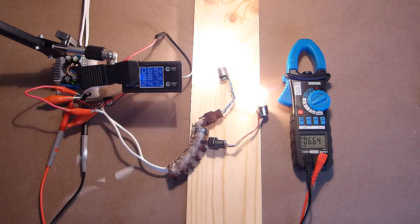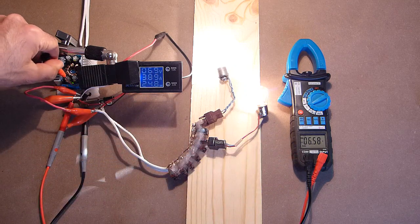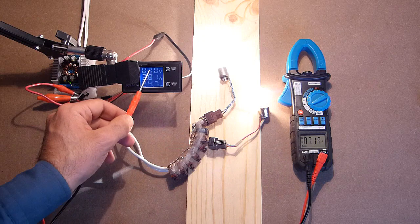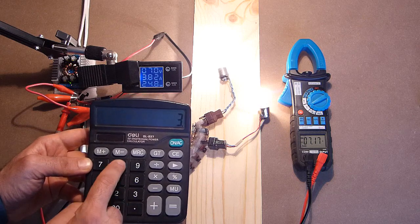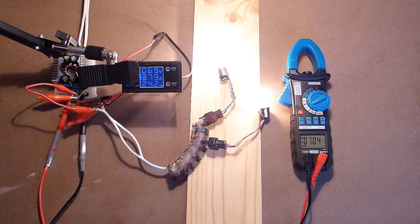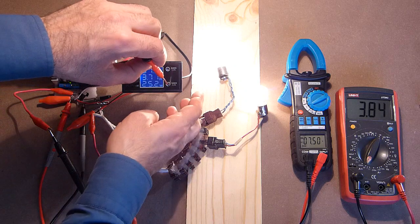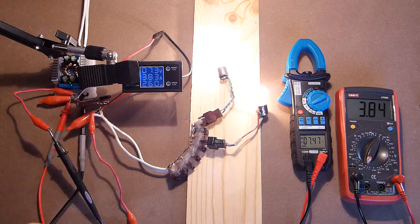The discrepancy may be due to insufficient operating voltage — here we have 6.9V and the reference reads 6.6V. Let's increase it. Readings are now 7.1 and 7.0V, at 3.82A. Anyway, 26.7W versus 24.7W. To check the accuracy in total, let's verify the current with another device — reading 3.8 to 3.7A. Let's also adjust it: now showing 3.83 to 3.84A.